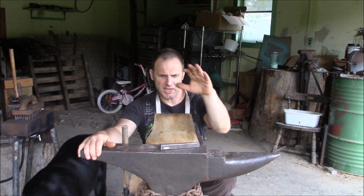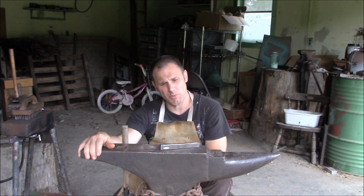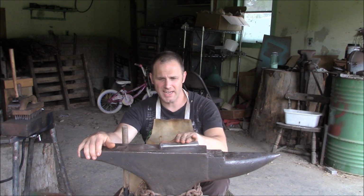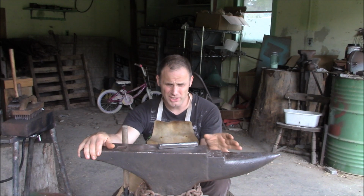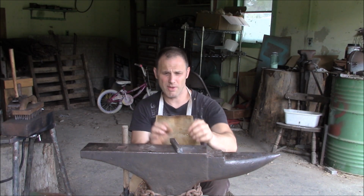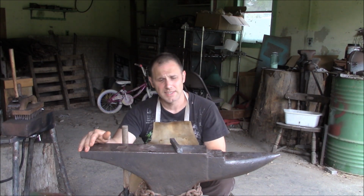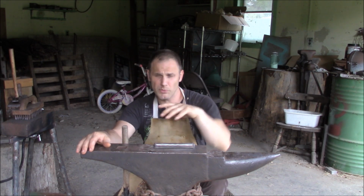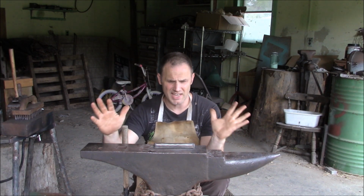We are going to be continuing on the billet of bandsaw blades and 5160. What you missed is I restacked it twice, so I'm at approximately 40 layers right now. I have dressed the edges in hopes that would assist in the next process of twisting it up. And I've also sealed in the edges with my stick welder, just to be sure they don't even start to pop apart at the ends.